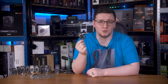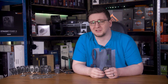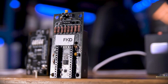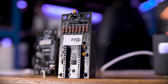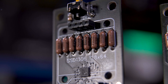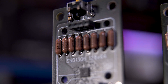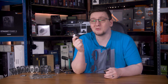The second problem the new CS boards solve is trouble with manufacturing and reliability. In the last two batches of OSRTT Pro boards that I've built, I've had a painfully high defect rate — specifically with the custom digital potentiometer I designed to control the gain of the light sensor. This is made up of eight resistors in increasing sizes and a switch chip that effectively bypasses any combination of those resistors, allowing the functional resistance to be modulated from around 1 kilohm to 1.3 megaohms. That means no matter the display's brightness, OSRTT Pro should be able to measure it.